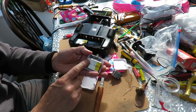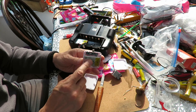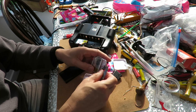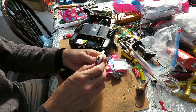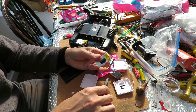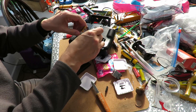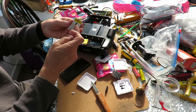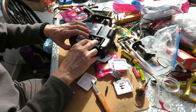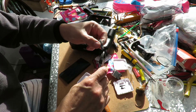Because these are inside a plastic container, this is the bare metal battery. The positive terminal is actually connected to that outer surface — so that's worth knowing if you're playing around with it. In one of my videos I actually managed to short out the battery by contacting the outer surface, and we had a little bit of smoke, which was fun. If you let the negative terminal touch the outside then you've got a short circuit. To be safe, because we've got open terminals there, we'll just nip these off.